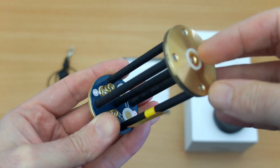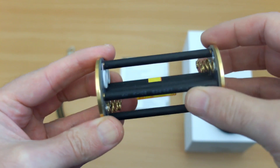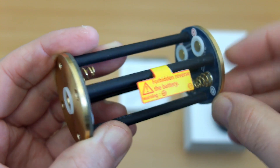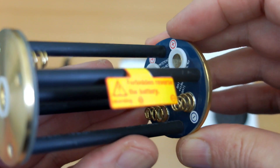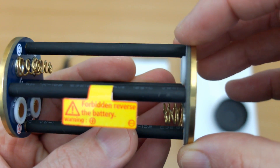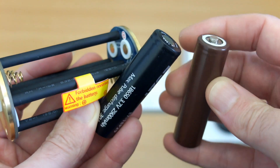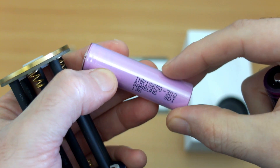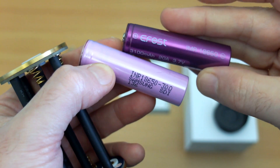This is the battery cage — it has brass top and bottom contacts, quite solid and well made, with springs. There's a warning about reverse polarity: it doesn't have reverse polarity protection, but the contact points are surrounded by plastic so you can't easily put the batteries in the wrong way. You need to use button-top cells with this; flat-top ones won't fit. I have some Samsung 30Q button-top INR cells here — I'll be doing a test on those later, along with an eFest cell.